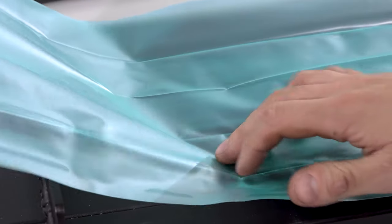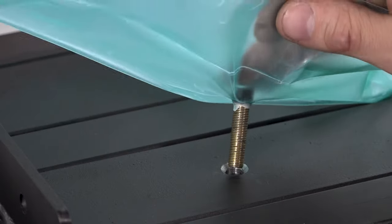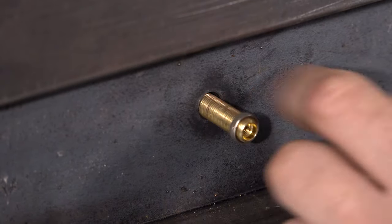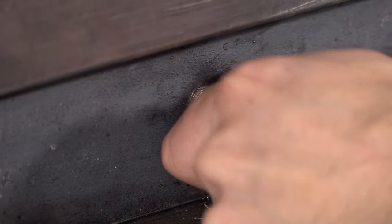The pressure connection can then be positioned and pierced through the bag before sealing the other end. The fitting I'm using for the pressure connection is a schrader valve for a tubeless bicycle rim with the valve core removed. This will seal to the bag when tightened down into the countersunk hole, then a hose can be attached.